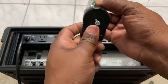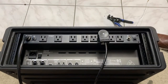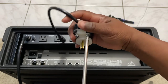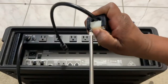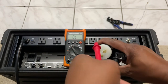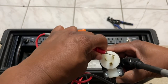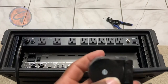I'm just going to allow it to loop around like so — that clears the middle so we can put that screw right down in it. Home stretch — when I tighten this part down I want to make sure it's absolutely centered, naturally resting in that groove. I'll tighten each side down a little bit at a time systematically. One more continuity check on all connections — good to go on all three. Here's the end result.